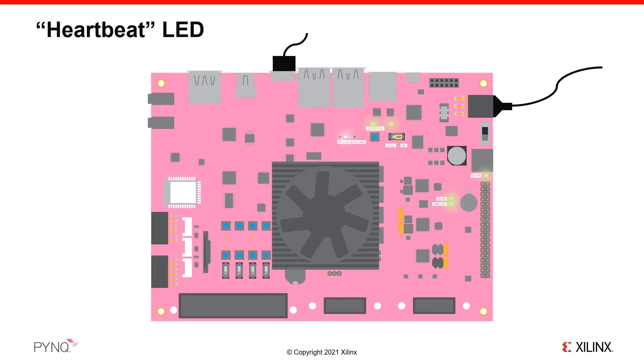After a few seconds, you should notice an LED start to flash in a heartbeat pattern. A few more seconds after this, you may notice your computer detects a mass storage device. At this point, the USB Ethernet gadget should also be set up through the USB cable. This will appear as a new network adapter in your PC, and the USB cable will behave as a network connection to the board — as if you connected an Ethernet cable between your PC and board. This network connection will be your main connection to the board when using PYNQ. The board also has Wi-Fi and Bluetooth, which can be set up later, but it's recommended to start with the USB gadget.